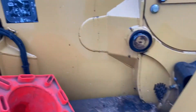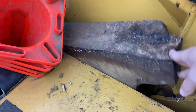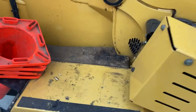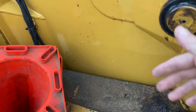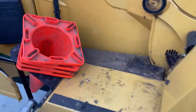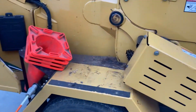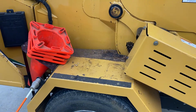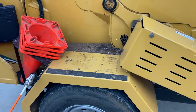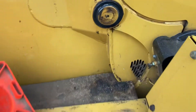Lastly on this side — debris, man. We bought a 6-inch mattress off Amazon, just a big foam block, and cut it down. What this has done is kept debris out of the machine in between the hydraulic hoses and electrical lines. So if we have to work on the machine, we're not spending an hour digging debris out and possibly damaging wires. On maintenance day, we just pull the blocks out, hose the fine dust out, and slap the blocks back in. To date, I've not had a rust issue with those blocks holding excessive moisture. The extra grease from this bearing winds up on the block, and we just wipe that excess off.